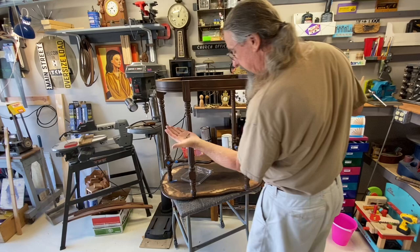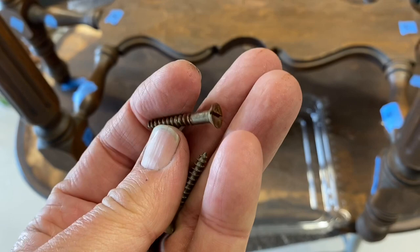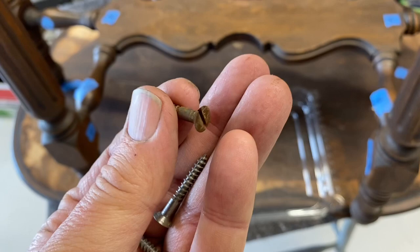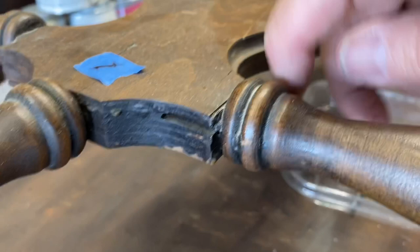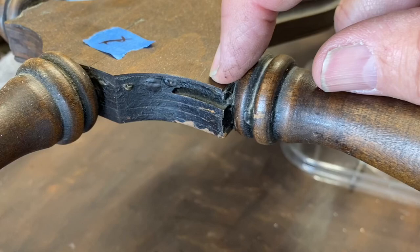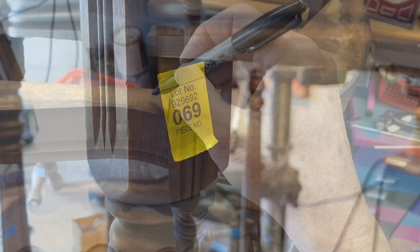Here are some clues to help date this piece. The screws that came out are pretty modern-looking — not last week modern, but probably 1920s or 30s, before World War II but after 1900. Another clue: the bottom shelf is actually a hardwood plywood of some type, about seven-eighths of an inch thick with six plies. There's also a little tag that looks like it was from an auction. I've match-marked everything to make it easier to get back together.